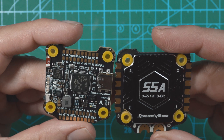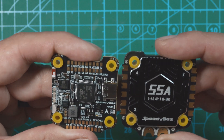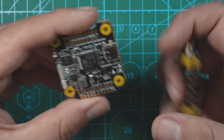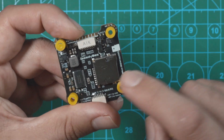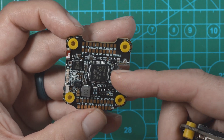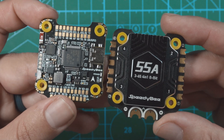That's pretty much the main stats to cover. It's $10 more than the V3 — you can get the V3 stack for $60, and the V4 is $70. Honestly, I think the upgrades justify the $10 difference. You get the 55 amp ESC that's more durable with better heat dissipation, the SD card reader issue is fixed, and you get 3 amp output instead of 2 amp output, which is better for the O3. I'm also curious how the ICM 42688P gyro performs compared to the BMI-270, since I've never had that gyro before. Let's go throw this on a drone and see how it does.